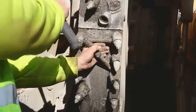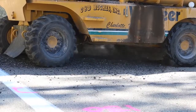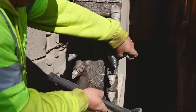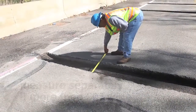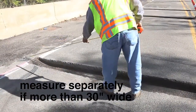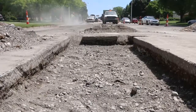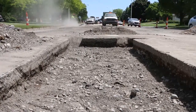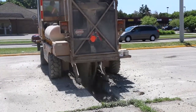This is a powerful machine that exerts tremendous force; there is a lot of wear and tear on the operator and even more on the grinding teeth, which frequently have to be replaced. If you see the machine bucking a lot, the problem may be worn-down teeth and the contractor should be notified. If the pavement joint repair exceeds 30 inches in width, the engineer will measure each 30-inch wide segment separately. Even though the grinder cuts a wide swath and removes a little bit of the sound pavement along with the unsound, it sometimes misses spots or otherwise fails to completely break up the materials.